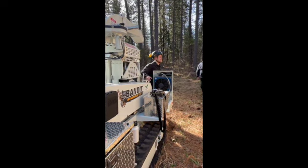Easiest way, guys, again, if you follow the manual, measure your distance between the two. A lot of times, a common mistake we see for new operators doing that maintenance is you do 10 turns on this side of the engine, you do 5 turns over here. You now got that engine cocked a little bit. When you drop this clutch in, your pulley's off just a hair, it shreds that belt right up. So you need to make sure, if you got the time, you got the patience, count your actual turns.